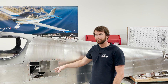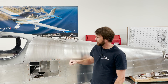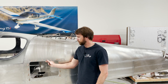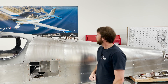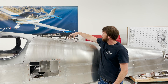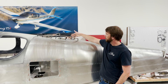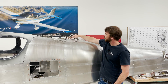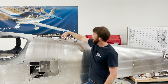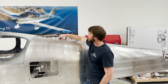While I'm fitting up this baggage door, which we'll do in a minute, I like to just leave it clecoed — that way if there's any adjustments or tweaking needed, you haven't locked yourself in yet. I have also left off my comm antenna reinforcement plate on the top, just clecoed for now, as well as the entire area around my parachute. These can actually be riveted now if you'd like.